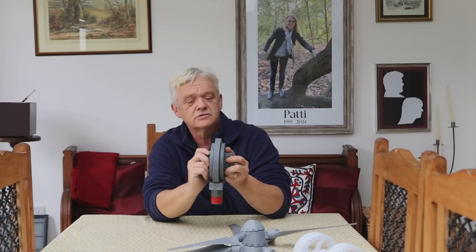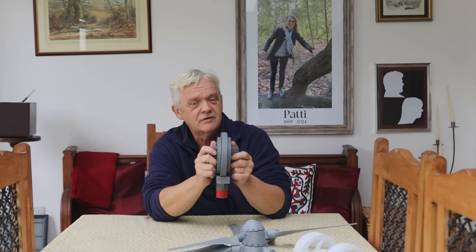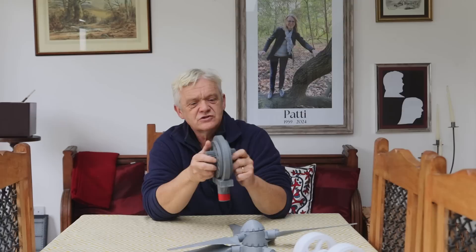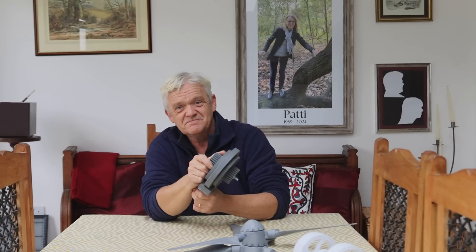Generation will drop off during slip. You might think we could just lock them together to prevent that — but if you did, the second blade, which is spinning slowly, would act like a sea anchor, creating drag and slowing the whole thing down. So that issue is what's hidden in this turbine, and the question is what to do about it.